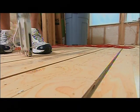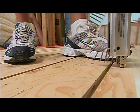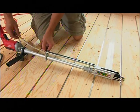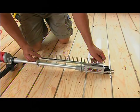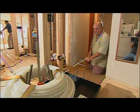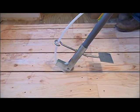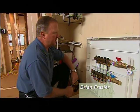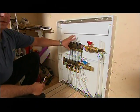Doing this by hand with a regular cordless drill would take you 20 years. When you're done, pull the coil out, grab a fresh strip of screws, slide it down the channel, feed it into the mechanism, and you're ready to go. The tubing goes in the slots — that's where the hot water goes, that's what warms the floor. Three guys handle the tubing: one puts silicone down in the slot to hold it in, the second uses a rubber mallet to pound it in, and the third manages the thousand-foot coil to make sure it doesn't kink or loop out of control — no leaks are acceptable. The manifold distribution system is where all the pipes from the floor come back and connect up.